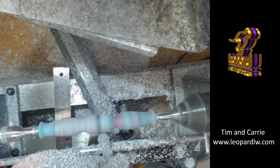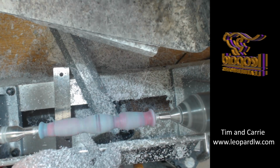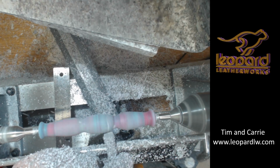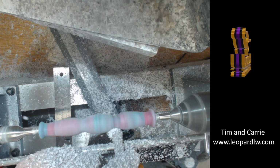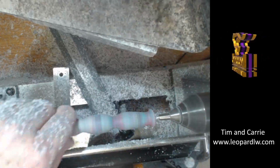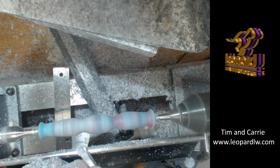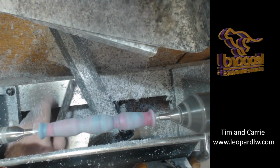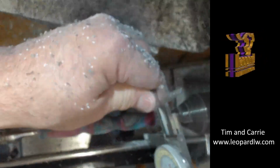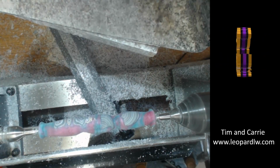All right, we're to the bottom of that. Let me shape the top of the ball here. Bang that in there. Okay, so a little trimming. Now we're going to do most of the shaping through here with the sanding block because we really don't want to cut much more on that. So I would say, let me check the finger grips. We're pretty much done with the hard part of this. 0.57, 0.56. So those will come down as we sand.